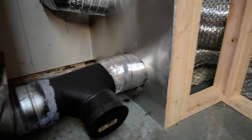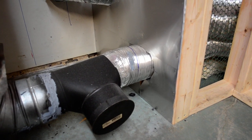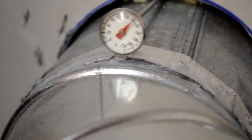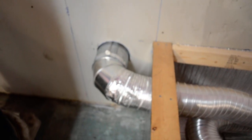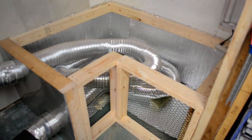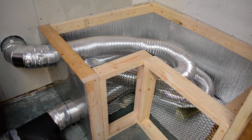I took some temperature readings — just past the clean-out I'm getting 150 degrees, and outside at the flue it's about 120 degrees. I suspect it'll be even less than that once the thermal mass is in there and all that stone absorbs the extra heat, but I can put my hand on it. That's pretty much my thermal bench. I'll take you outside to see the flue.